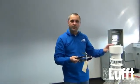The last of the external sensors is our leaf wetness sensor here. This sensor will be connected directly to the WS sensor, and for that sensor you can only use the WS401 and the WS601. So this will not be connected in the cabinet. It will be connected directly in the funnel of the precipitation sensor of the WS401 or 601. I will show you that in a moment. So this is the leaf wetness sensor here, and this will be connected directly to a WS sensor. And you can only use the WS601 and the WS401. That means with the precipitation funnel here.